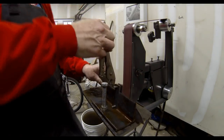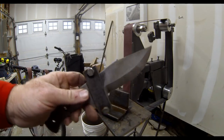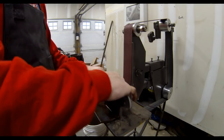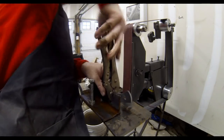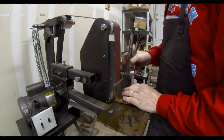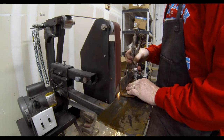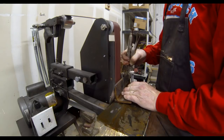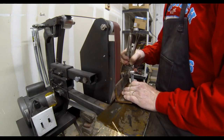Once the bevel is done on one side, I'm just going to unclamp, turn the blade around, and reposition it on that same bevel jig so that I can grind the other side of the knife. You'll notice that each pass or two on the sander, I will dip the entire blade and actually the jig itself right into a bucket of water to cool it down. This is now just grinding the bevel on the opposite side of the blade. A lot of people do this freehand — I'm not one of them, just not that good. I use the bevel jig and the plunge jig to make sure everything comes out nice and straight.